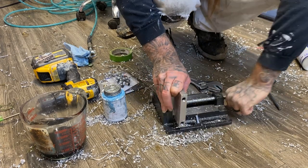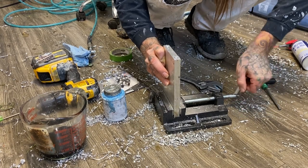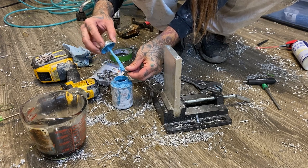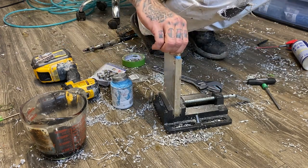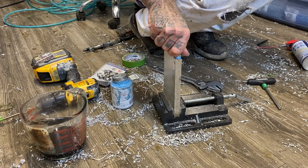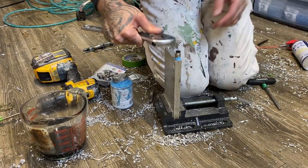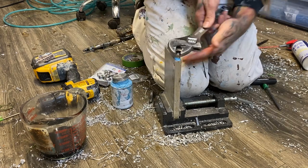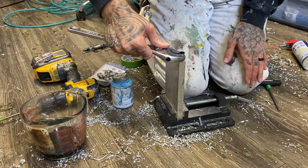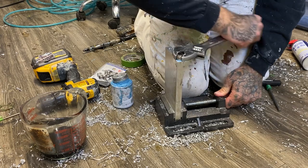Flip it up — this side here is the easiest part. You don't have to go super deep with these side fittings. Put a little pipe dope on there, get it started, give it the gorilla grip, and start cranking it down. Sometimes they can be a bit cantankerous trying to get them started — just take your time with it.